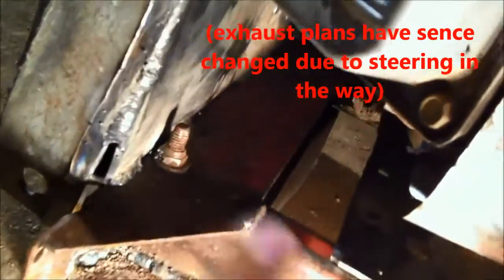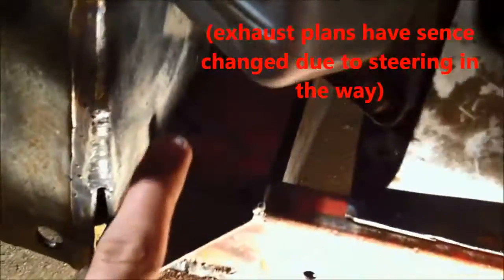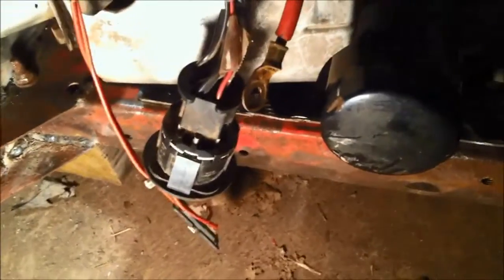You see I got the engine sitting behind it, but I did a couple seam welds, or a couple beads to the box itself, then I added these 3 gussets and welded them all solid. And I'm not sure if you'll be able to see here on the back side. Yeah, see there's a couple welds. And once I do exhaust, because I'll have exhaust running right behind this beam, like 2 rows of pipe, then I can add some gussets on the side, on the corners here. And I think I'll just put 2 there, and that'll be plenty solid. I'm about to weld up the engine plate that's bolted to the engine. It's pretty much all centered up.